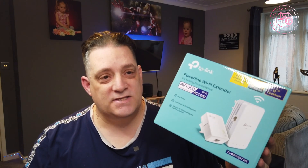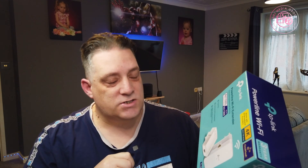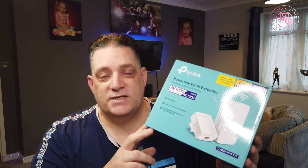This is going to be installed in a friend's house. We've got this going in along with two of these, so three in total. We've got a ceiling mount going in as well, and a small five-port gigabit switch — this is all gigabit range. So if your internet is over 500 megabits or more, we need to make sure our internal kit supports that speed, otherwise you end up having bottlenecks with your own equipment.